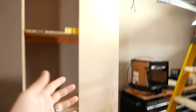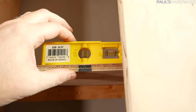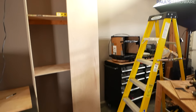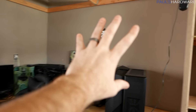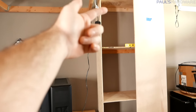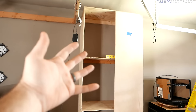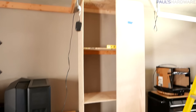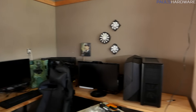Here's a look at one of the doors just kind of propped in place. The doors are also plywood but they're birch plywood, which costs just a few bucks more and has a nicer finish. On this one I went to the trouble of sanding and using my router to go right along the edge. These shelves are also almost completely level. Coming up soon: I'm going to clear all this out, paint the wall — probably mostly the same gray but maybe a little bit lighter — and paint the entire frame of the cabinet that same color. At the same time I'm going to caulk and seal up around the edges and back to keep dust out. The birch front doors I'm going to leave with a natural wood finish, sticking with the gray, wood, and black theme, which I kind of like.